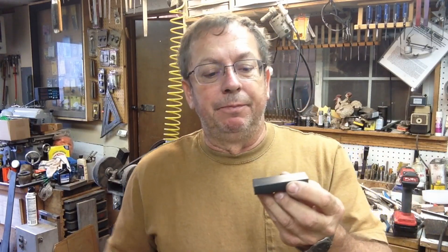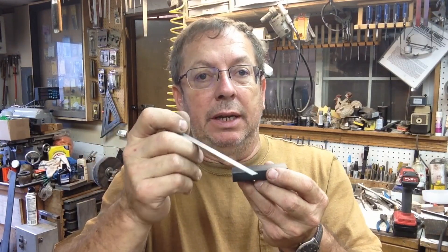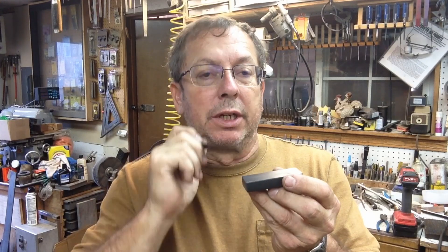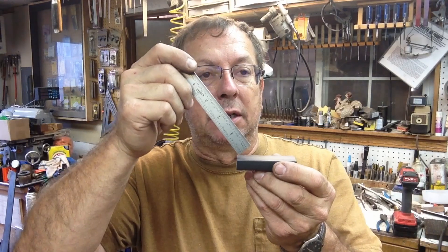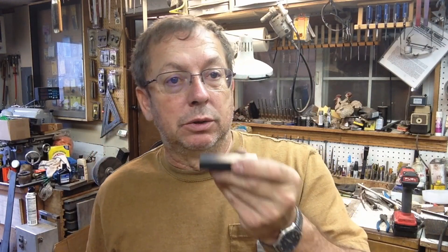What we're going to do is set it up in the middle, drill our two holes — these are just clearance holes, not the countersunk or recessed holes for the screws. Then while we've got that set up, we'll do our cross cut, which is a quarter inch cut about a quarter inch deep. Then we'll make a cut with a three-eighths cutter and widen it up — we need about 0.4 inch width to clear. After getting dimensions right, we'll flip it over and countersink or counterbore the top for screws.